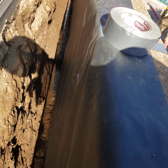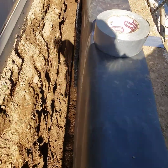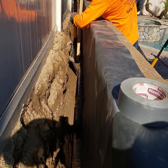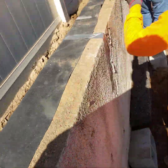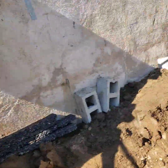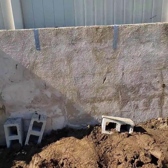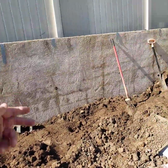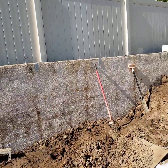You can see it's a three-board-high curtain drain, so that's 27 inches. We have to brace it so that no dirt is getting in between the Hydroblocks and the membrane — it's a slow process but it's going nice and steady. The chalk line marks how high the curtain drain is from the base. Any water that comes through is going to hit the Hydroblocks, sink down, and we'll have weep holes all along the base of the wall.